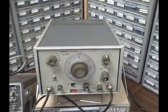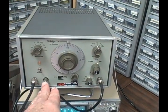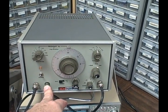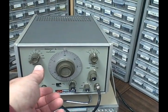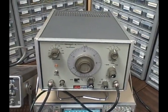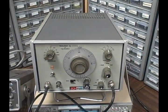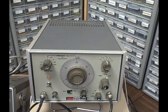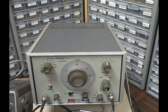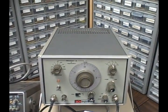There are two modes to run in. In dial mode you manually dial in the frequency, and in addition you can apply a plus or minus 15 volt signal which will cause a 5 percent modulation of the range you're on. If you put it into the external minus V mode, then a negative going 0 to 15 volt signal will sweep the frequency from zero to its maximum range.